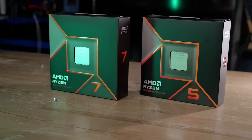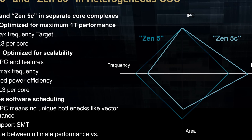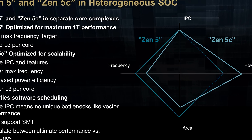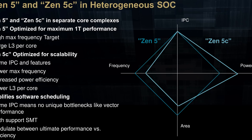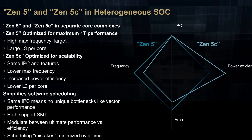It's a very different approach that AMD is taking. With the Zen 5 C cores, it's still the full core, still full functionality. It's just clocked lower and with lower power delivery — a design optimized for efficiency. Because it's optimized for efficiency, the power wires are smaller on the silicon lithography, among a whole bunch of other changes that aren't needed when you're not going to clock at five gigahertz. But you still have some other cores you can clock at five gigahertz, because as a practical matter you weren't going to be able to clock all those cores at five gigahertz anyway. So they don't actually need to be physically homogenous.